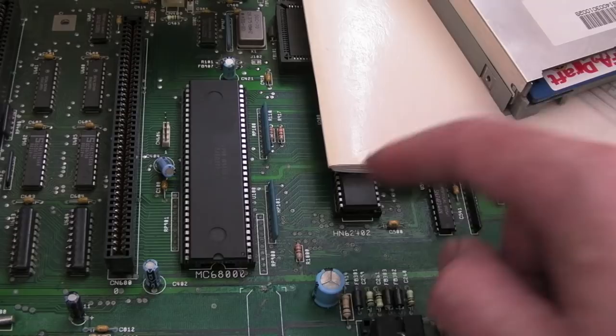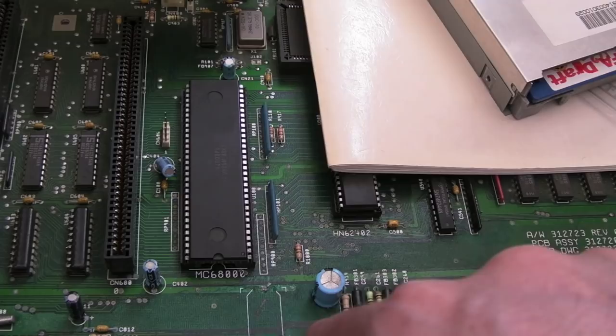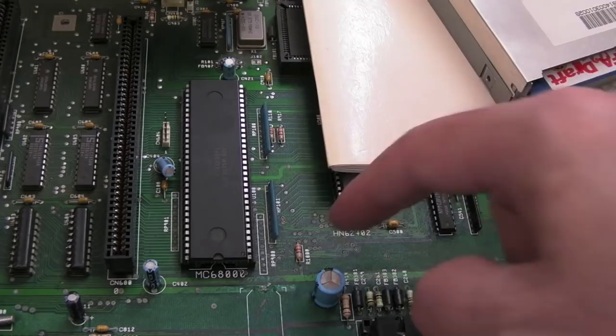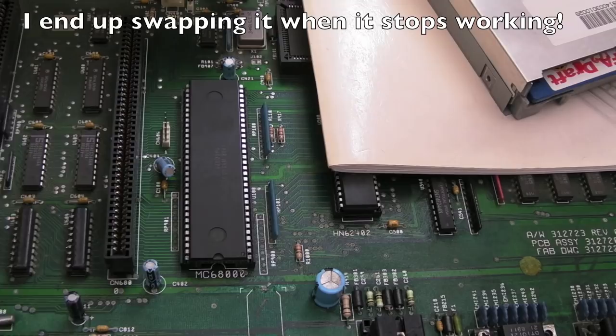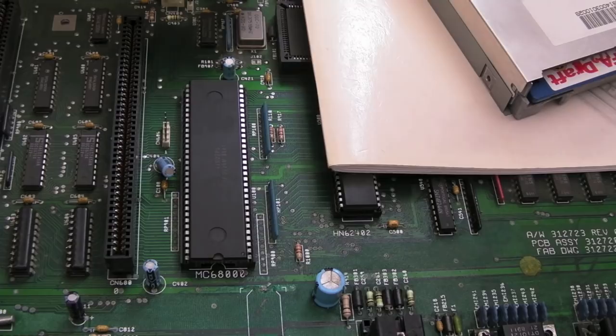What I think I'm going to do is clean up the vias — scratch the surface to get them silvery again — and use the fiberglass pen on the little black bits around the battery area and these traces. I think I will touch up the ones around here and get a bit of nail polish over some of the little bits, but I don't think I'm going to swap the socket out. I'm going to take a risk — and just show you that sometimes you can get away with the bare minimum to get these up and running.